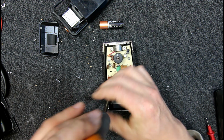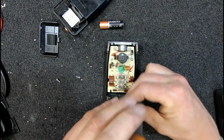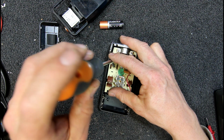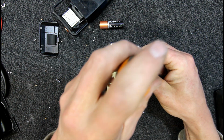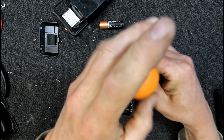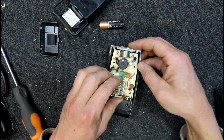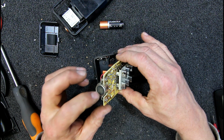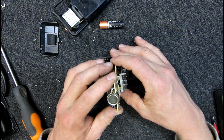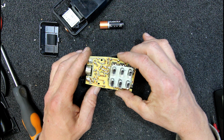So I don't think any normal microphone is going to pick them up, even though obviously we can't hear it, but you could hook a normal mic up to an oscilloscope and see if it picks up something, I guess. The other option is basically just to hook an oscilloscope up to the output device, because if it's feeding that, then chances are it's working. Don't think these little transducer things ever fail, but it does have a little bit of dusty stuff in the front there.